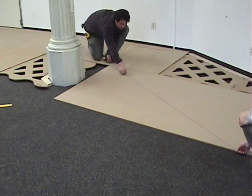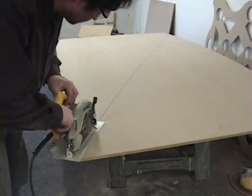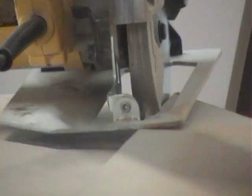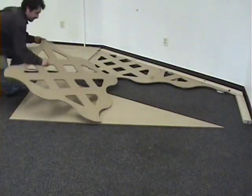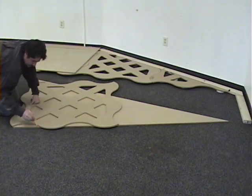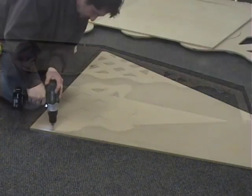Then we'll cut MDF to cover the customizing panels and fill in the floor. You should leave 3/8 of an inch to 1/2 of an inch between the edge of the wall and the floor. We pre-cut the sheet of MDF to either 84 inches long or 42 inches long and then measure to cut and fit. You should countersink the holes of your screws before attaching the MDF.